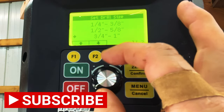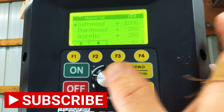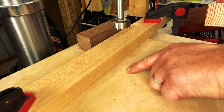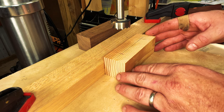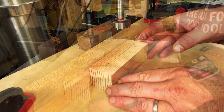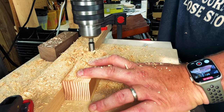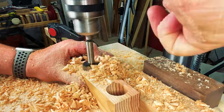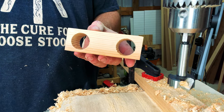I love this new tool — all I need to do is select the speed chart, select my Forstner bit, and choose one and a quarter inch for softwood. One thing to note: I have a backer board to prevent tear-out. I'm going to bore out a hole at both ends first, and then slowly creep down the middle.